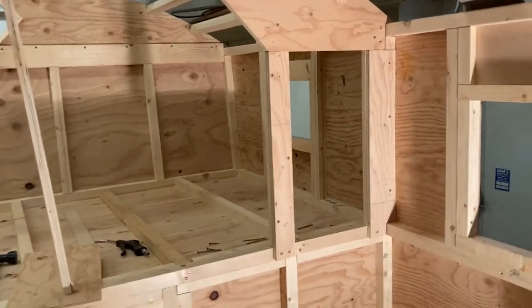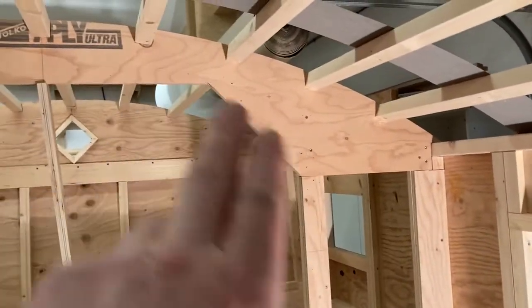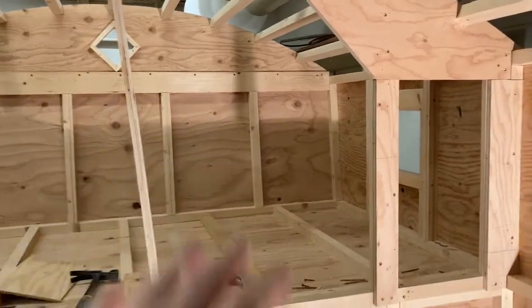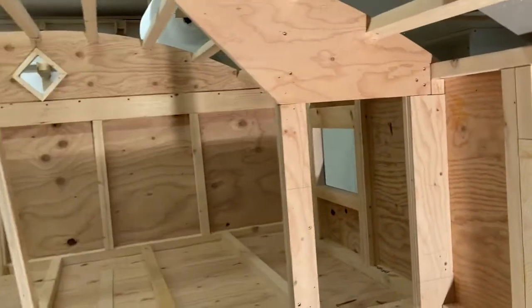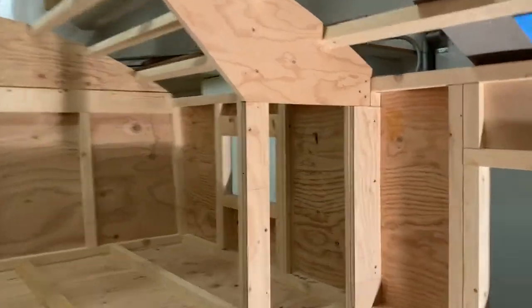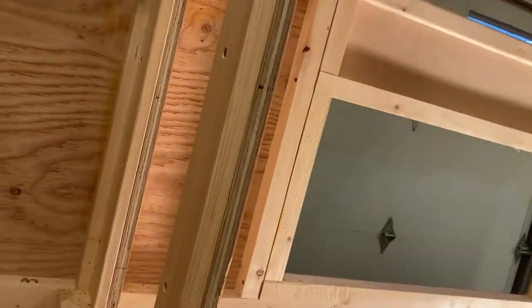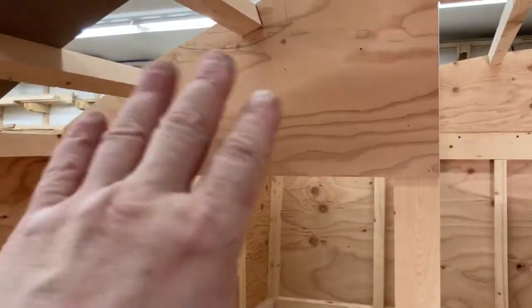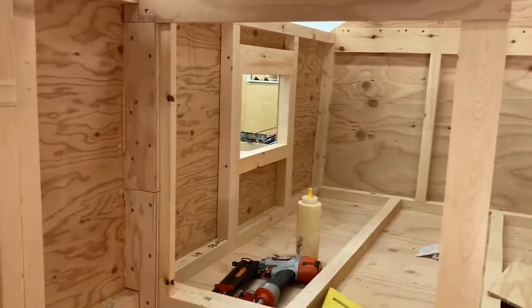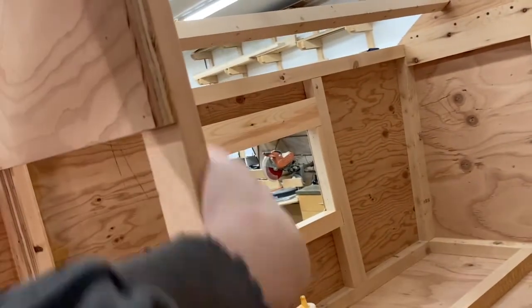A little update — I've been framing in a few pieces for my archway here. This is the bench side. That's the reason I cut that angle, just to get a bit more open space when I'm getting in and out. This is actually going to stay open; this will be filled in. This will all be clad, I think in fir. I've also got to fill in all the pieces on the back so it can be clad — these will be wrapped like little posts. This side of the plywood is a weird thickness, so I've got some scraps I'm going to fur it out with. That will probably be paneling, at least on this side. On this side I might do a little upper cubby.